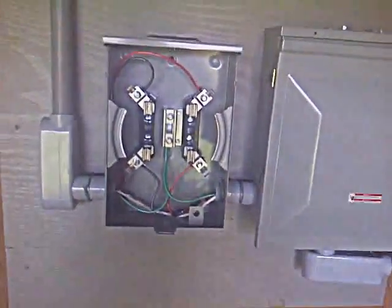So that's how the system works. For an Enphase system, it's pretty cut and dry. AC comes down out of this pipe right off the inverter, it goes through the kilowatt meter, from the kilowatt meter it goes into this two-pole breaker, from the two-pole breaker it goes into the sub-panel, and from the sub-panel it goes down this pipe. It goes into the main electrical panel on another two-pole breaker. We have a 60-amp line feed in this panel. So on the other end of this pipe there's a 60-amp two-pole breaker, and that gives them an option to add more solar — which he's actually going to do. I already set a pull string in the pipe here so we can pull more lines up.